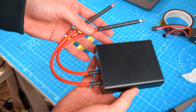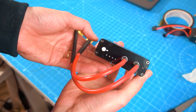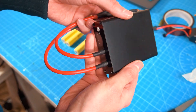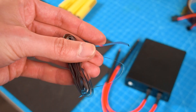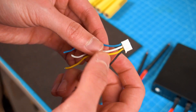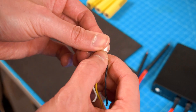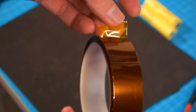First let me show you everything I'm going to use to make the battery pack. First is a spot welder — not very expensive nowadays and specifically made for these batteries. I'm not going to use a soldering iron because that could damage the cells. I also have nickel strips, an XT60 connector from an old battery, and the balance port as well — from a dead 3S pack. You can also buy these connectors separately, and high-temperature-resistant tape is very handy.